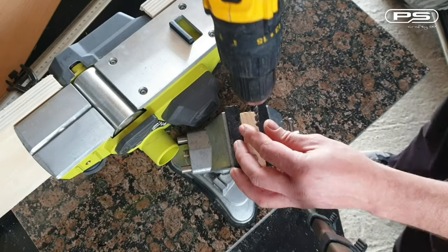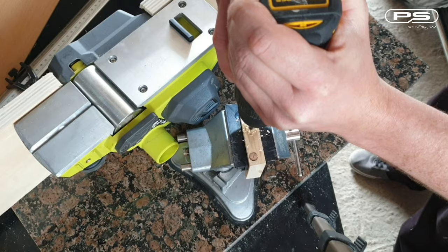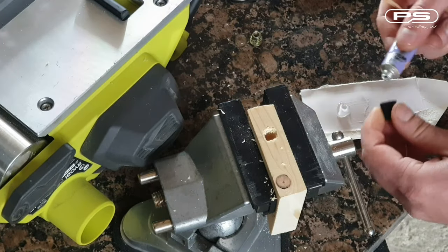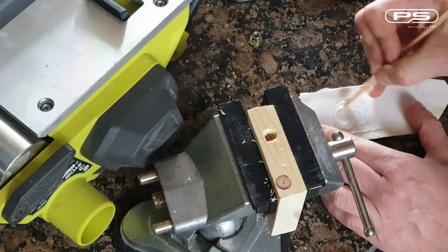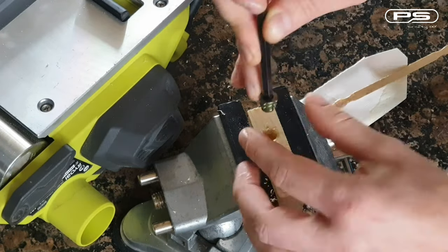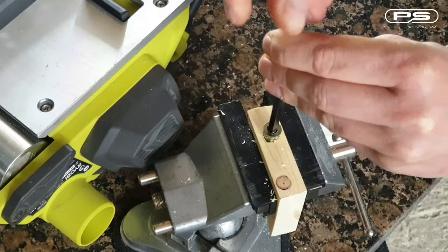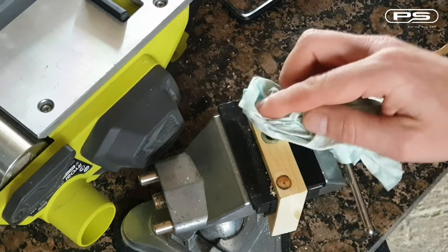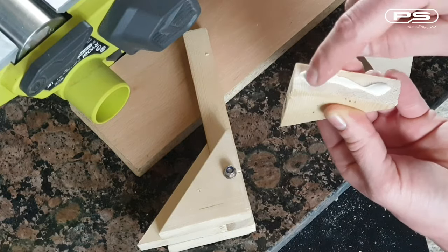There is another triangle piece that fits at the top. Before I glue it onto the pillar, I drill it out and fit a threaded insert using two-part epoxy glue. The threaded insert will provide a fixing point for a protection blade guard later on, so now it can be glued onto the pillar.